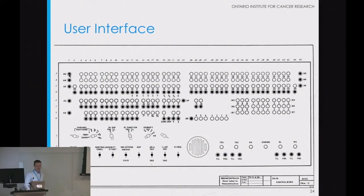And then on the sides, you could zero parts, like the left or the right side of the registry. So if you wanted to zero something, you could just press this button and it will zero out everything in the registry. So this is the multiplicand and multiplicator registry. I don't know if I translated those correctly. The next one down is the address registry. No, the accumulator registry. And in addition to being able to zero that, it also has buttons so you could program. So if you wanted to put a specific value into the accumulator, you could use these buttons to do that.